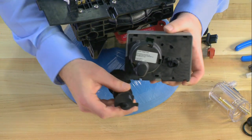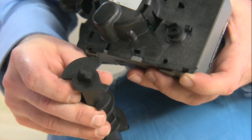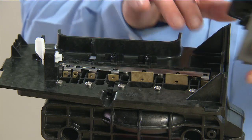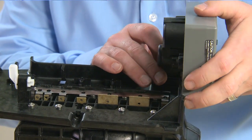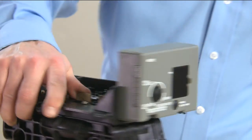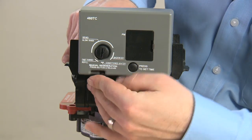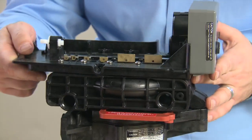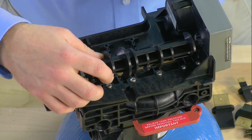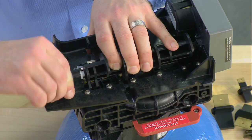We can then begin our reassembly of the cam and timer assembly. The square is offset on the center of the cam to the center pin, the same as it is offset on the timer itself. We can reinstall our timer by pressing down and reinstalling our pin from the front. We rotate the pin upward. Making note of the offset, we reinstall the cam into the back of the timer. Pressing downward and back engages the white clip that we rotate down.